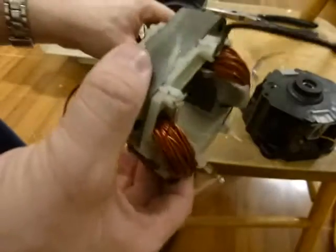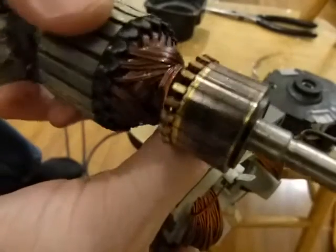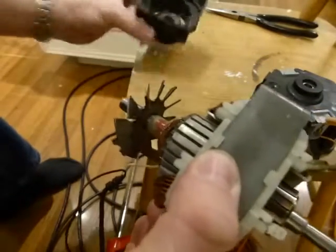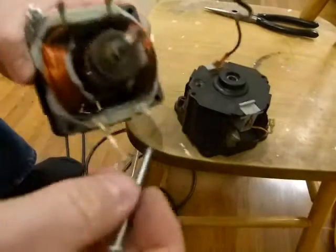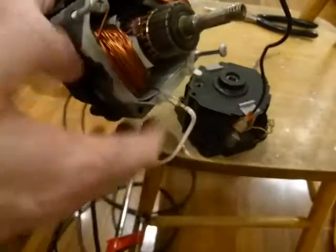Here you can see the nice clean commutator segment. This was in here like so — of course it's held in place by this bearing at the end. Very simple, doesn't need lubrication, but I will add one drop. This was there, and everything is held together with these two bolts. That's all my motor story — that's how it works, so you can make sense of what the voltages and measurements were.